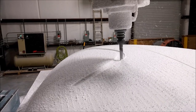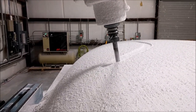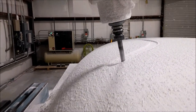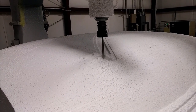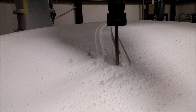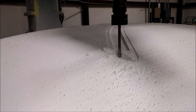There's a hole where the pin will go through to hold the actual strap. This is the first pass cutting the channel itself, running back and forth to cut it out. Next is cutting out the hole where the parachute strap pin will be, using a three-eighths inch ball mill and going up and down creating this sort of indentation, using a back and forth process.